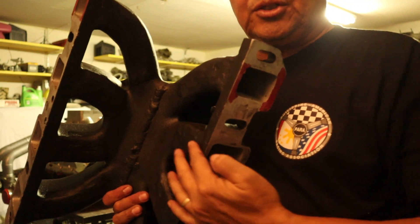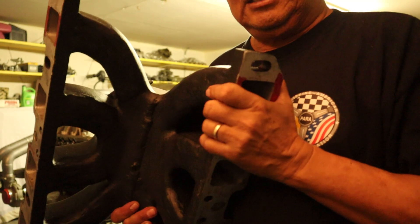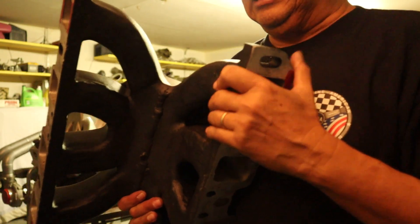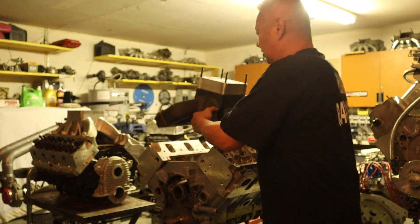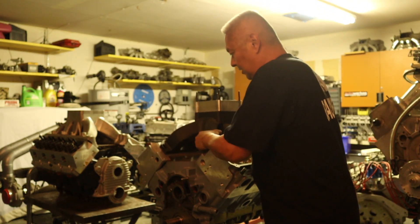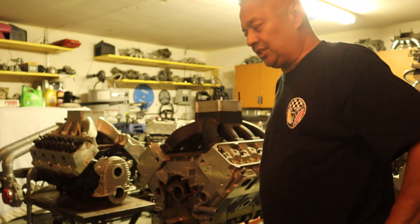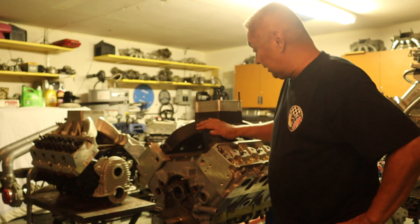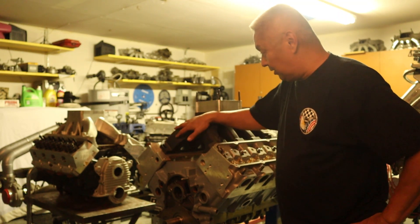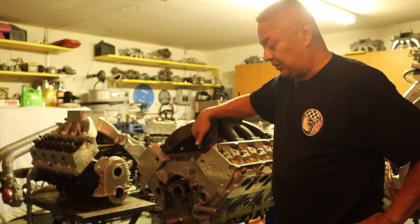See all this welding? It's been split up and cut years ago. One half is bolted on the heads so I could flow test it and evaluate my cylinder head with the manifold in place. That's why it's cut in half. You can see all the welding underneath.